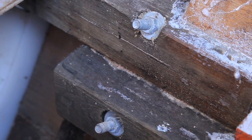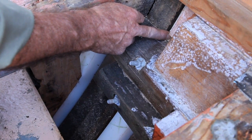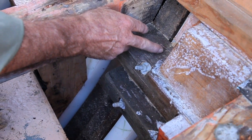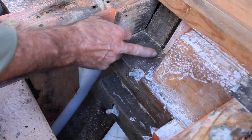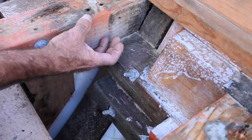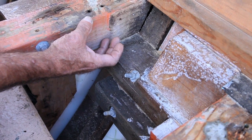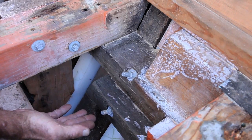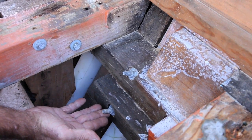The clamping is bolted off to the plastic frames with three-eighths inch galvanized bolting — actually a machine screw hex head. Only the hex head is buried in the plastic on the outside, to eliminate the large hole you'd need for a washer. With plastic frames, you don't need washers underneath them — you can't pull the head of that bolt into the plastic frame — so we've reduced the size of the holes in the plastic frames where we bolt the clamping to the framing.